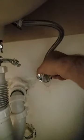We'll start with the removal. Each new faucet also comes with a new drain plug. First thing you do is clear out the mess underneath and get yourself some rags, because this stuff will drip. I'm going to go through this one more time tomorrow just to make sure everything is good and tight. First thing: turn off the water — for me it's clockwise — both of them are off now. The easiest way to get these off is a wrench on the bottom. Unscrew it — I'm cheating a bit since I've already pre-loosened it. On top, this is screwed into the copper ends, so jiggle the hose as you're turning and you should be able to get it out by hand.